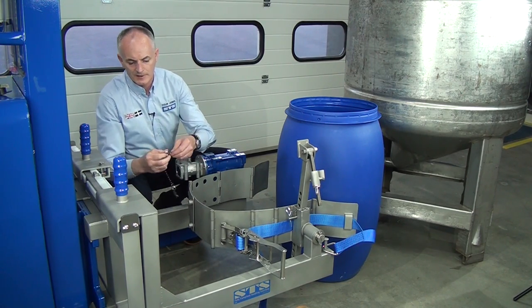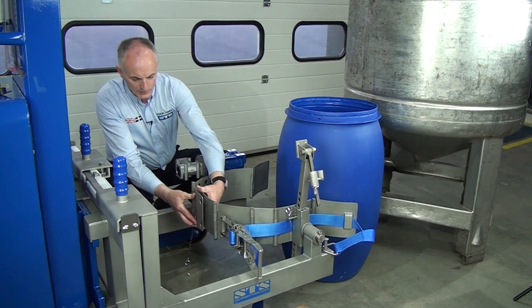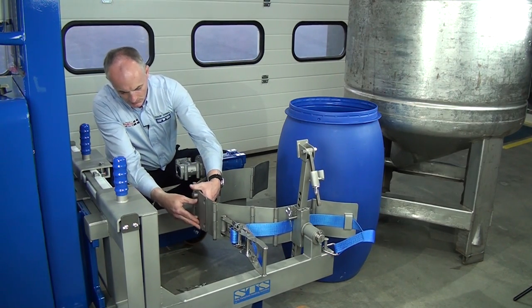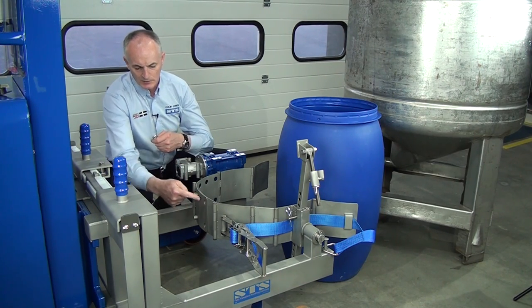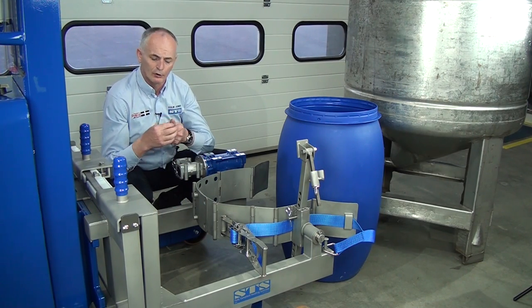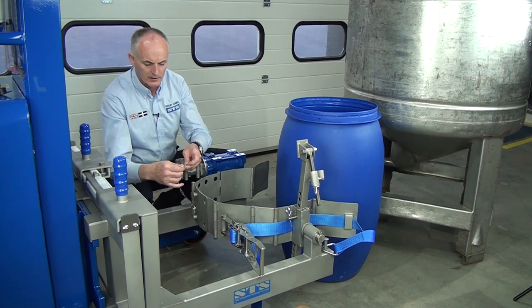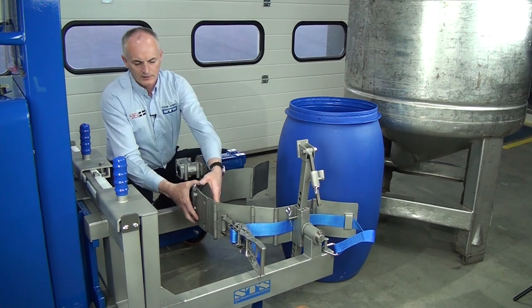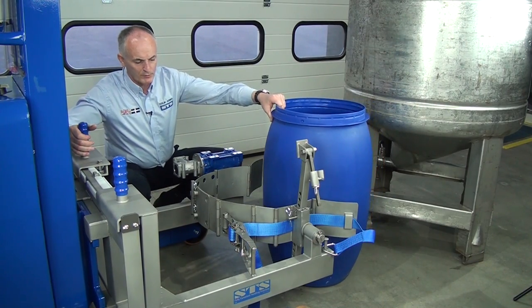Remove these two pins, grab hold of the arm, and then we just socket that in the next two pin positions there. So you can see these sticking out the back of the unit there. So we've moved it one whole position forward. Then re-put the R pins in the back of the band. That now joins the band. You can then open up the band. And you can see now if we bring this drum in,